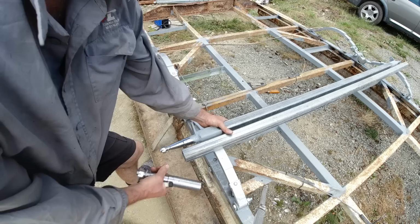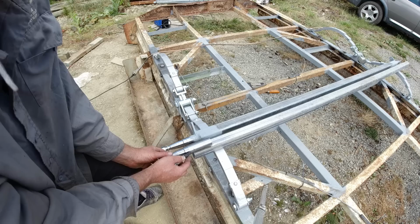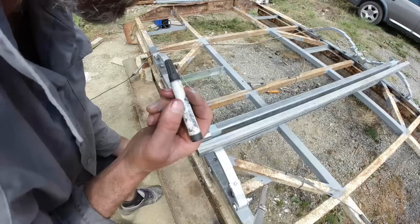Alright, now onto the front axle. This one is not braked, so the axle tube is going to be longer because this one doesn't have the brake holder on it. So I'm going to go 20 millimeters from the edge of the seal lip there, and that gives us just about 80 mil in the tube. I'll line that up with the end of the other one, bang on about there. So that one will go that far in,